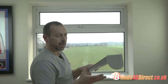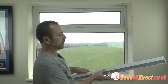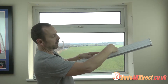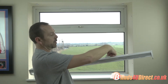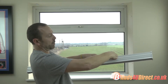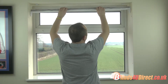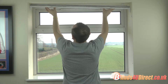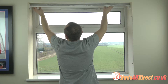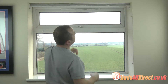To fit — it's a little bit fiddly, let me show you. Your top fix brackets fit into that groove there, so the front of the blind goes into the bracket. Then you push the back up into the bracket and it clips into place. So: head rail up, slide it forwards until it engages in that groove, then push at the back — there you go, head rail fitted.